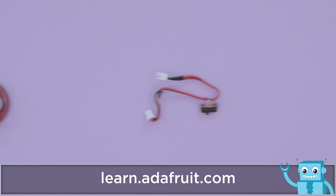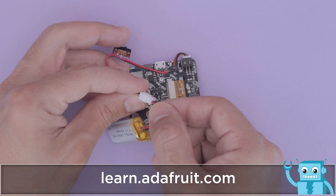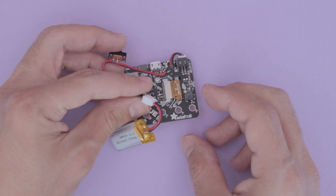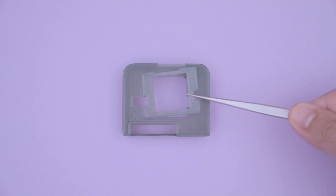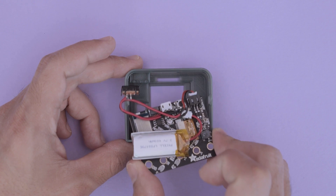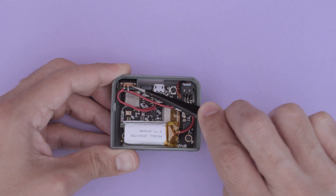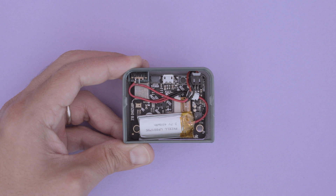To make this portable you can wire up a slide switch JST adapter and connect it to a battery. Connect the battery to the switch and fit it on the back of the Clue board. Secure the screen bezel by adhering it to the case using super glue. The Clue board easily fits inside the case by press fitting it through the screen and button cutouts. Fit the switch into the holder by inserting it at an angle.